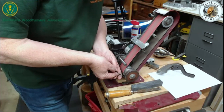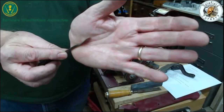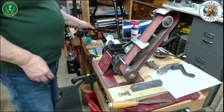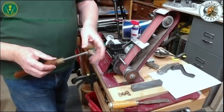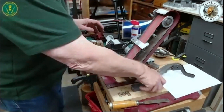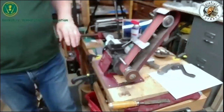I would just burnish it like that on the honing wheel — it's probably too close for the autofocus. What you immediately note when you try to do that is that if you've been using the wheel, from having rubbed a tool up against it on a couple of occasions, there's a trench worn in the middle. So the same problem as with all wheels: you need to dress it. I use a grinding wheel dressing stick.